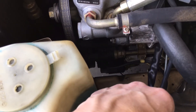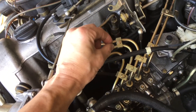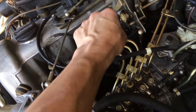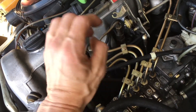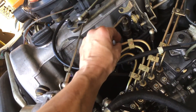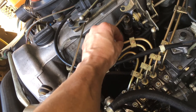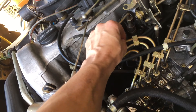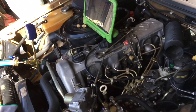Just like diesel lines — these metal lines actually flex, expanding and contracting with every pulsation of the injector. They build up pressure, the line expands, the injector opens, the line falls. There's actually an RPM monitoring device where you clamp it onto the injector line, measure the flex, and it tells you when the injector opens — you can actually read injector firing RPM that way.